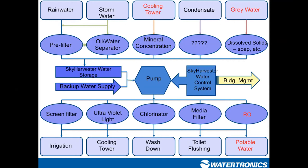Cooling towers take in city water for a heat removal process, but inside the tower they inject chemicals — disinfection agents, anti-scalant, and others. The water evaporates but minerals like calcium and iron, along with injected chemicals, remain and concentrate. Over time they purge the tower, discarding a slug of water with a super high total dissolved solids (TDS) concentration along with those chemicals — making it potentially unsuitable for irrigation or plant life.